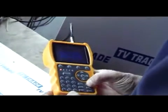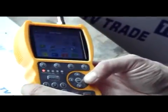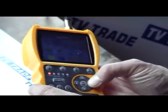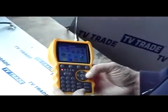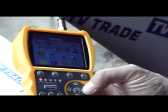The satellite ID function is for when you have a signal and you're not sure what satellite it's from — simply connect it in and identify the satellite. The packet control lets you check every single transponder on a particular satellite to see if there's a problem with particular packets or transponders. The DiSEqC motor control is used if you're using multiple dishes or a motorized dish system — you can move the motorized dish and save particular settings. The spectrum analyzer is for identifying problems with particular signals, very handy for technical work where you need to pinpoint exactly where problems are arising.